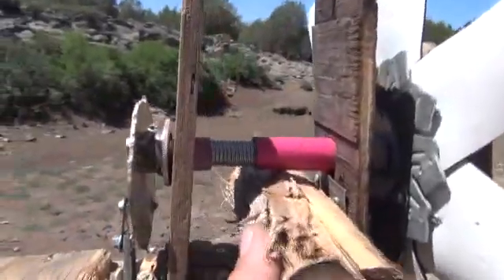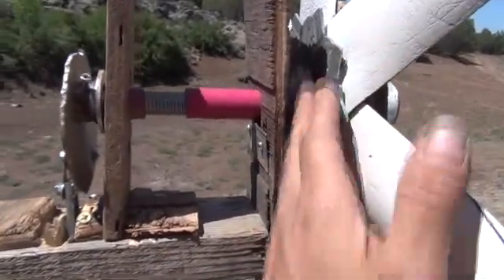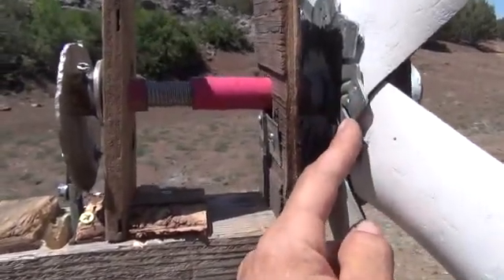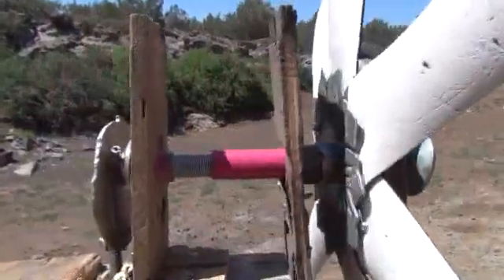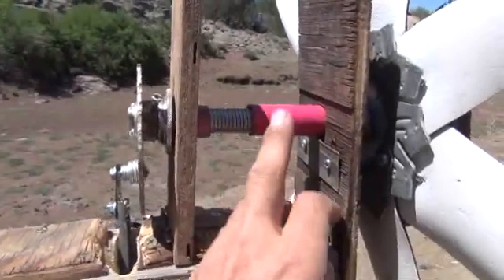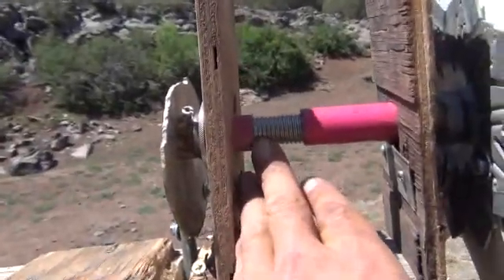Alright, here we are back again. I'm going to pull this piece of wood right out of there for now. I just want to show you how this mechanism works and what it's built out of. This piece right here is just for mounting the blades — it's extra steel. I was thinking about putting some neodymium magnets on the back side of this to also light up a light over the fish pond, but that will be later on in this project. It's just a flattened out alternator fan. The center bolt you see through here — you see the tip of it sticking out right there — that is actually the jack bolt for a camper jack. I just thought it was a nice long shaft, something that would work well. Inside of here I drilled some pieces of wood out for that piece to go through and I cut a couple handlebar chunks from a bicycle for the bolt to actually spin inside of, so the bolt wasn't grabbing against the wood — it gave me a protection sleeve — and I did the same on the other side.